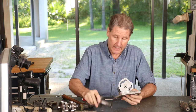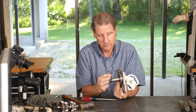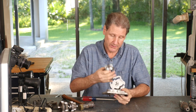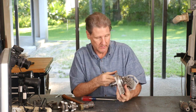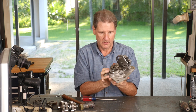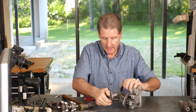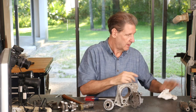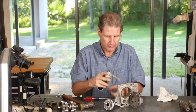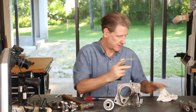To put it in, I didn't want to hammer it from this side since that's hammering out the clutch gear. I just kind of wanted to go like this - center it up. Everything's different by a couple thousandths. Clean it, and a little bit of tri-flow, just a scratch, to go in there and help this guy seat in.